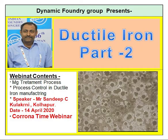Knockout practice. Cooling time should be 45 to 75 minutes after pouring based on your grade. As I told you, for ferritic it should be 75 minutes, or more than 60 minutes we can say. For pearlitic grade it should be 45 minutes. For ferritic-pearlitic you can go between 45 to 60 minutes. So it depends on the grade and your section thickness and the requirement of your matrix and hardness.